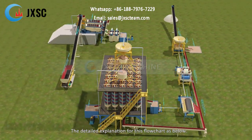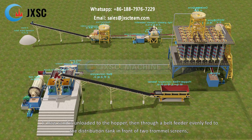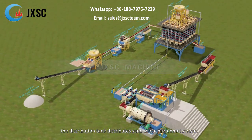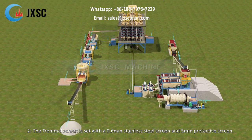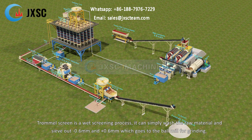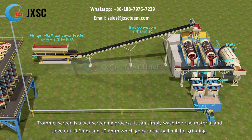The detailed explanation for this flowchart as below. 1. Raw sand is unloaded to the hopper, then through a belt feeder evenly fed to the distribution tank in front of 2 trommel screens. The distribution tank distributes sand to each trommel screen. 2. The trommel screen is set with a 0.6 mm stainless steel screen and 5 mm protective screen. Trommel screen is a wet screening process. It can simply wash the raw material and sieve out minus 0.6 mm and plus 0.6 mm, which goes to the ball mill for grinding.